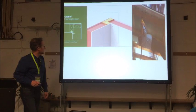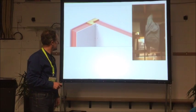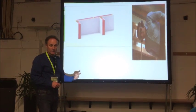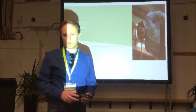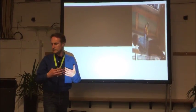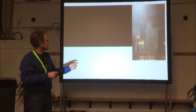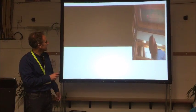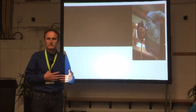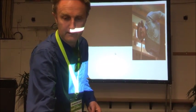That's me running around taking the dwangs out — that was good fun. The dwangs were vertical so you could have continuous insulation, and I've removed them completely so you can get thicker insulation in there. If you haven't got dwangs, you can run your plumbing and electrical without cutting or drilling holes. The green shows a rigid air barrier — that provides better structural strength and also makes the house more airtight than a wrap.